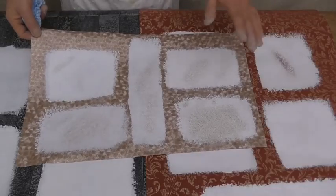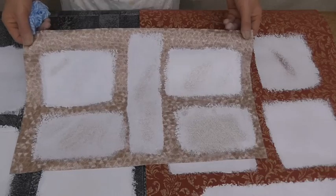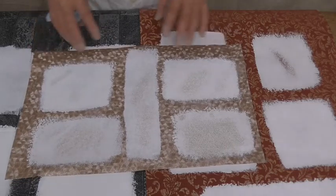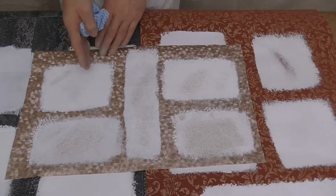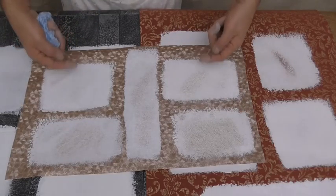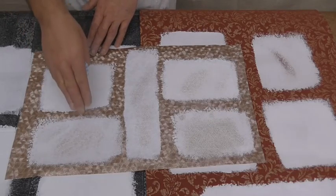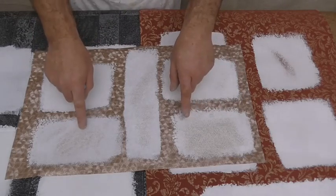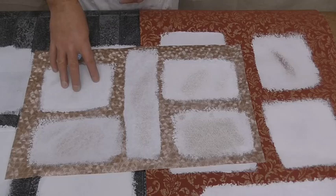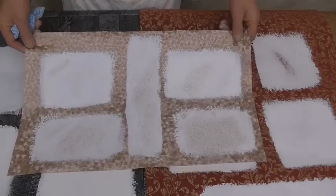And by far the worst paper of all of these is this sort of hammered brass type look. This metallic finish. Very shiny, like I say, very sharp raised pattern to it. When I applied the paint, this side is the scrubbable and this side is the wipeable, and I put the silk here instead of down there. So yeah, all the others were at the bottom, so you can clearly see the difference. So scrubbable, wipeable, and then silk on top. So it's performed better, but definitely I think that would need a primer. Strip it off and just put something else on. Line it and paint it.